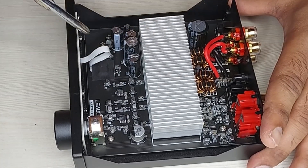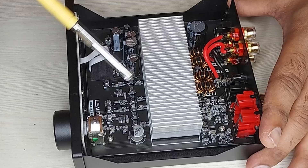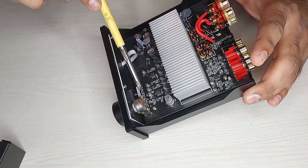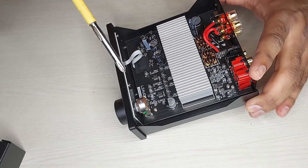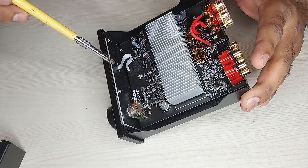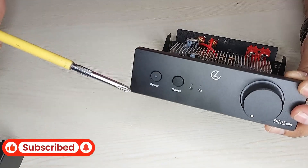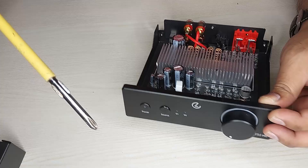The main circuit board is at the bottom, covering this whole area. All the input/output sockets and the volume control are mounted on the circuit board. The volume control is a 50K potentiometer, mounted to the kit using a metal bracket for sturdiness. On the front side there's also a circuit board — the switches and lights are there. You can see a small ribbon cable for the power button, the source button, and the ring LED light around the volume control knob.